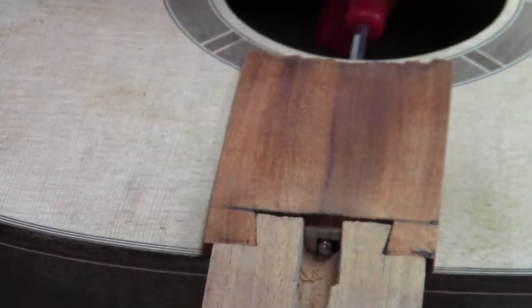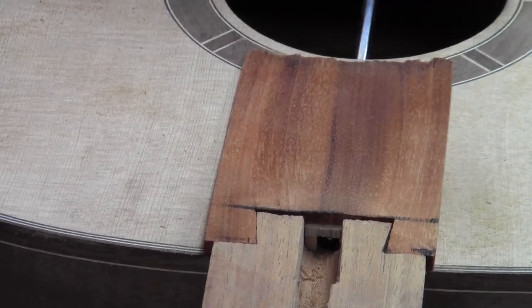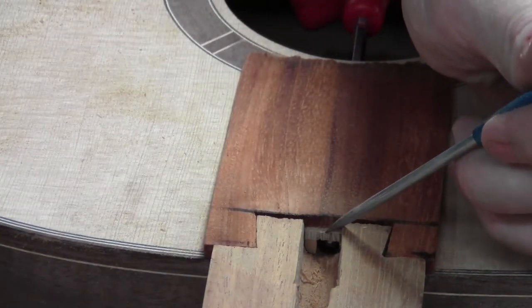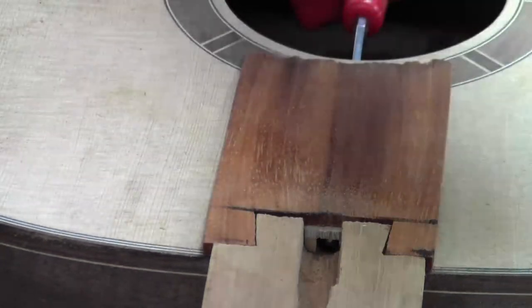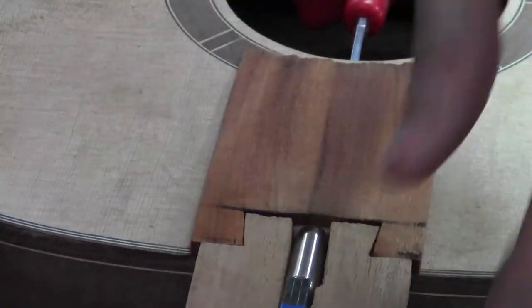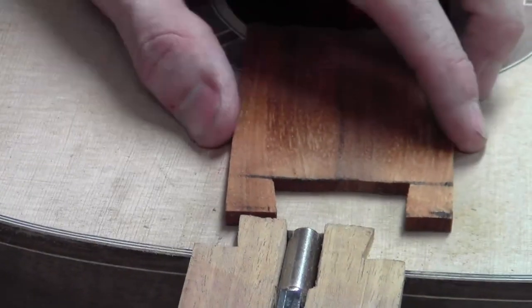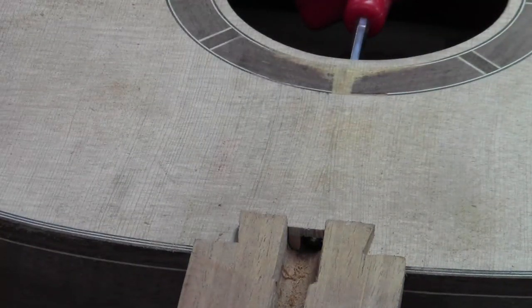So what I shall do is I'm going to take that wood that's down there in the way right there, this bit and the upper part of the, hang on, I've got a thing I can point with. I'm going to take this bit of it and this side bit out with a chisel, so that I can aim the wrench up. And I'll probably have to pull it back about 3/4 of an inch. I don't think, let me double check that. Yeah, I don't have to take anything from the shim. I just need to take a bit out of the top here to reach the gap that's down there and widen things just a little bit so that there's some wiggle room down in there.